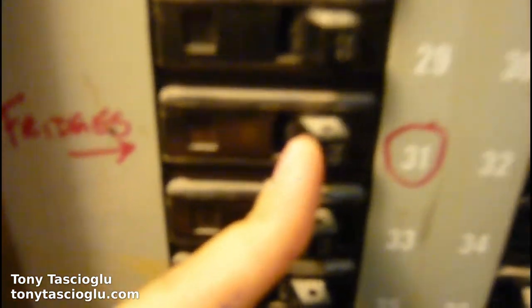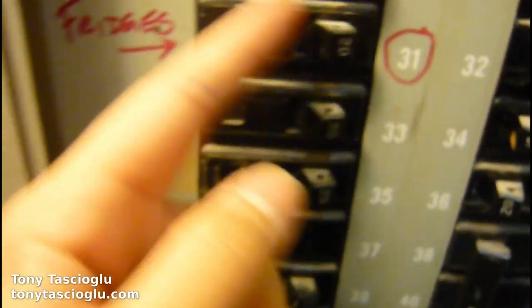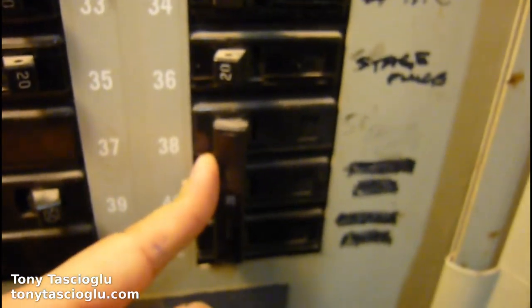Another thing backstage is the power panel — this is a breaker panel. There are a few breakers of interest to stage crew. First is the PA breaker at 20 amps, which provides power for the plug down here as well as the amplifier rack I showed in a previous video. If you're too lazy to open it you can just cut power to the amplifiers from here. There's also the drama office breaker. The fridges from the cafeteria are a common one — during a school play we usually turn this off because the fridges are very noisy. Finally, breakers 38 to 42 are a triple breaker for the motorized lighting bar in Market Square.